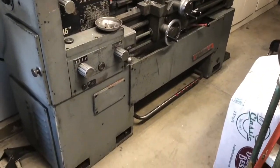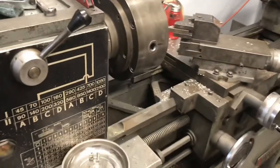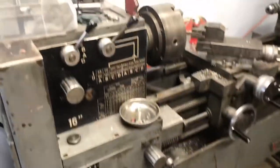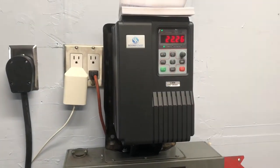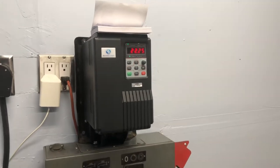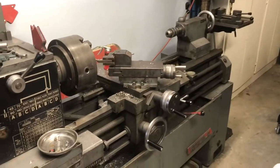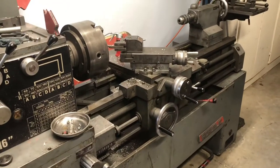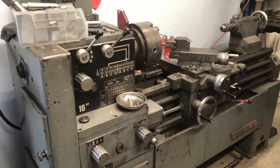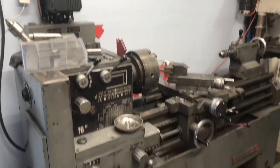What's up guys, just want to make a quick video of my new-to-me Republic lathe. This model has a 16 inch swing and was originally manufactured in 1977 in Spain. I just got it set up with a VFD, so I got the original three-phase motor running off of my house 220 volt power. So far haven't really found any issues with that — seems to be working out pretty good. I am able to run both the coolant pump as well as the motor off of the single VFD without issues. Under normal operation it draws about 12 amps per leg from my house power.